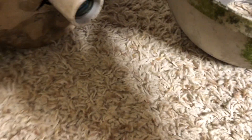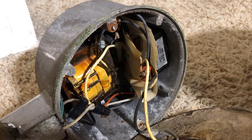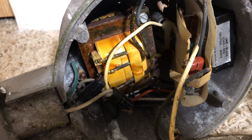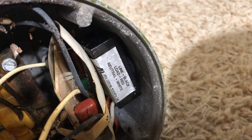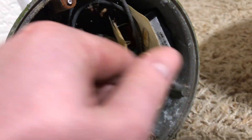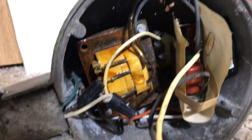I can see the screw is still holding it in — let me get it out. At first glance, I would say this is definitely high pressure sodium because we do have some type of igniter assembly here, and of course we have a ballast. Doesn't look mercury vapor. We have our photocell — it's by Area Lighting Research. I'm not entirely sure what wattage this ballast is; it probably says on it, I'll try to find out. But here we have our first look at the fixture itself.